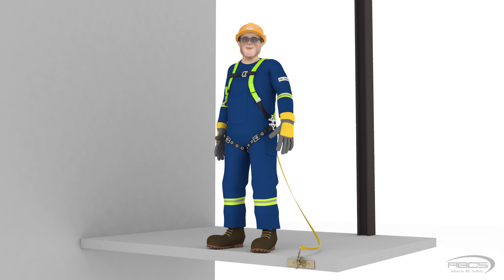If tying off at the same height as your D-ring gives you a freefall of the length of your lanyard, what happens when you tie off below your D-ring? The lower you tie off, the higher your freefall distance becomes. For every foot you tie off below your D-ring, you are adding 1 foot of freefall to your lanyard length. If Abel were to fall from this position, he would fall 5 feet to be level with the anchor, and continue freefalling the entire lanyard length of 6 feet until the lanyard is hanging straight down from the anchor and pulled tight. So essentially, you must add to the lanyard length the distance that the anchor is below your D-ring.